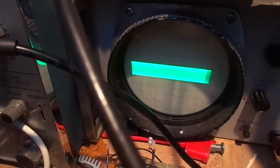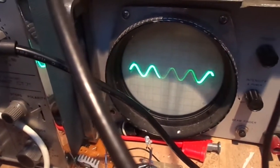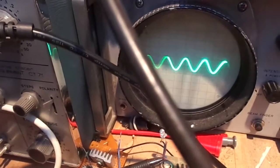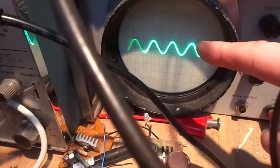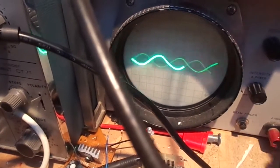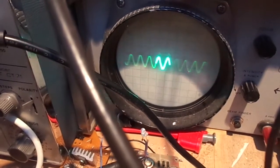Now let's go the opposite way. Frequency 100 hertz. Just have to change the time base. Yeah, I know it's not going to be, we haven't really got a, what do you call it? There's no trigger on this. Right, but that's still 2 dB. Let's go down further. Frequency 50 hertz. Oh Jesus. Yeah, that's starting to distort, look. Let's have a look at distortion. 5%.